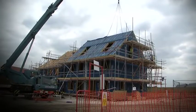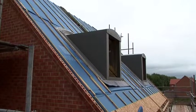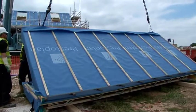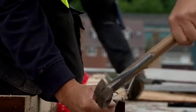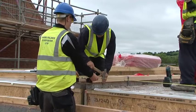The press roof system has been designed to be installed on both timber frame and masonry built structures. All press roofs have an easy to follow installation drawing, and this should be referred to as the installation progresses. If the installation is built on masonry, it is important that all the wall plates must be line and level and all dimensions checked prior to any lifting.